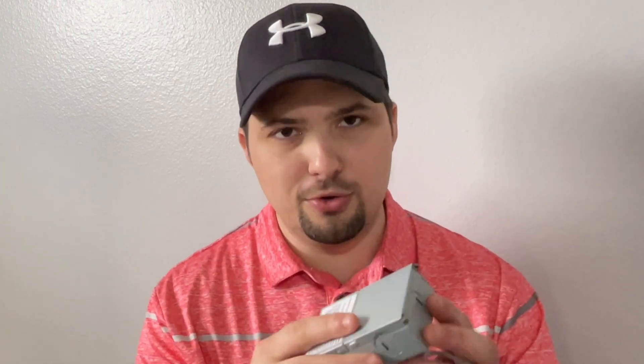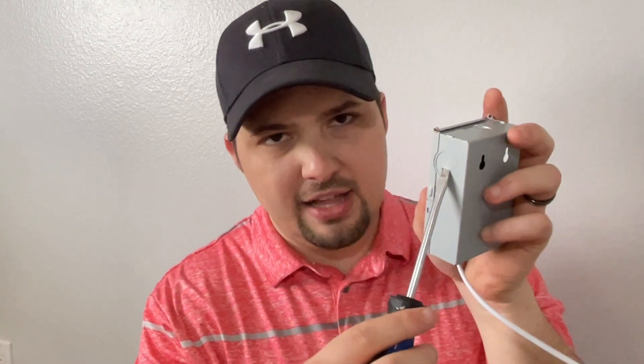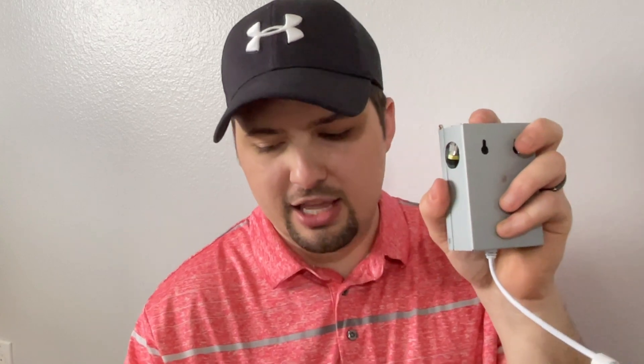My light is still working and my house has not burned down. But from my reading, you do need to add one of these connectors to the light box fixture. In the previous video, I showed this box with punch-outs on the sides. I'm using a flat head screwdriver to pry out the knockout — there's a little notch. You can also use your finger. As you can see, I've just pulled that knockout out. I'm now running my finger around the edge of the hole feverishly, and as you can see, it did not cut my finger — so this knockout is not inherently sharp.